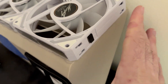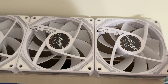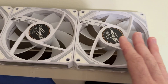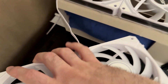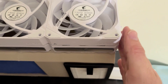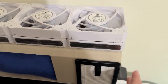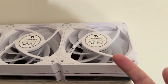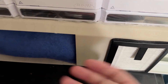With the design where the fans actually sit inside, so the box is actually bigger — I'm going to feature it at the end of this — it doesn't have this problem. I also put a little bit of our fans in it. But the air gets drawn back into the middle. You'd think doubling the fans up would solve that problem. However, it didn't at all. I was still getting air drawn back into the middle of the central hub, despite there being two fans basically sealed against each other, creating more static pressure.